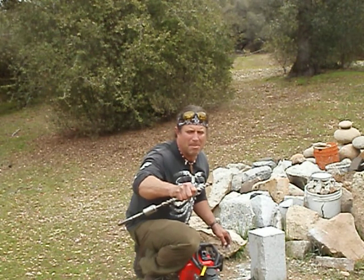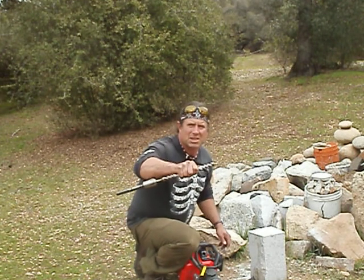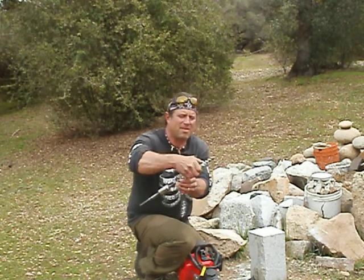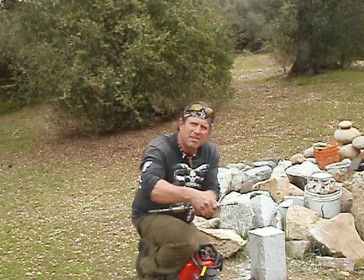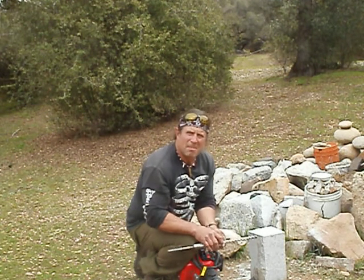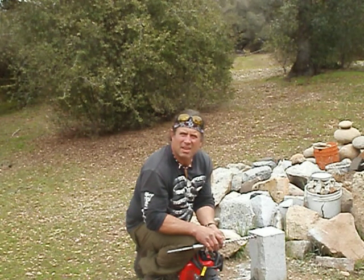I didn't really time it or anything, but that's, you know, about 3 inches in that short amount of time. So if you're running plugs and feathers, maybe you're going to go 5 inches for the depth of the plug for a 3/4 size bit, something like that. So you're looking at a minute and a half of drilling at the most.